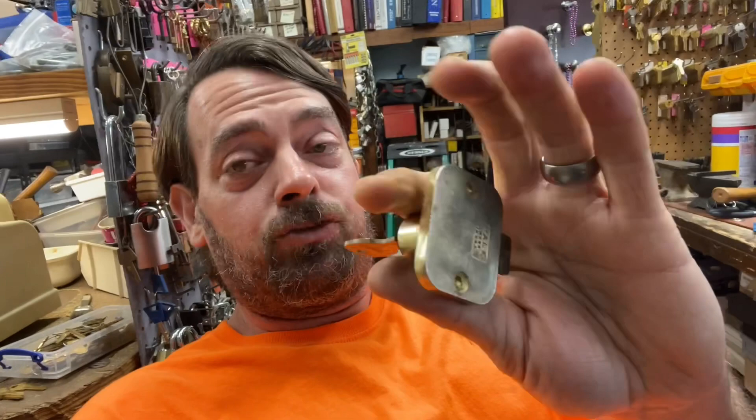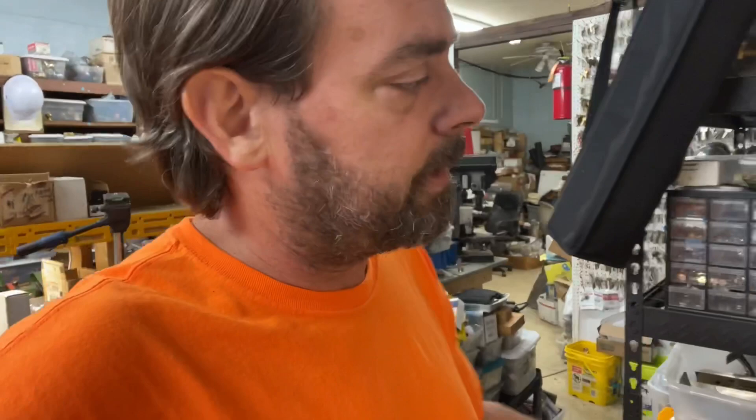It surface-mounts onto the back of a door or drawer, typically a drawer, and screws in with these two little screws. You might notice this key in it — the customer brought it in with a post office box key, which is not the right key. Typically with these Yale desk locks they use the Y14, or possibly Y12, because I actually have a few of these original Yale locks with the Yale keys and they were using the Y14. These are the same as the little round base ones you can pick up for a few bucks.